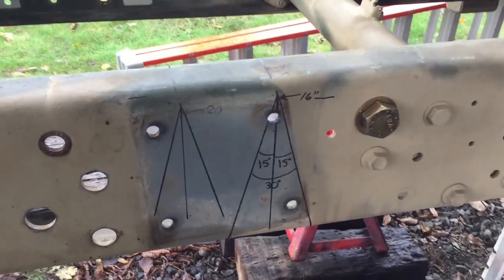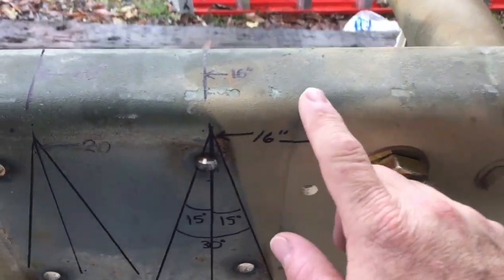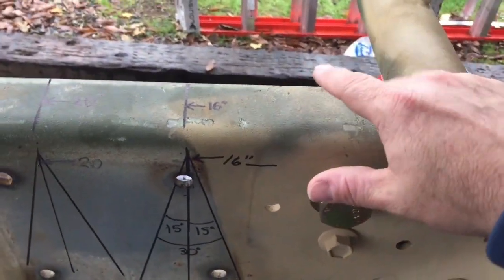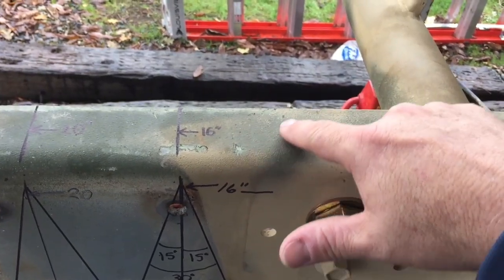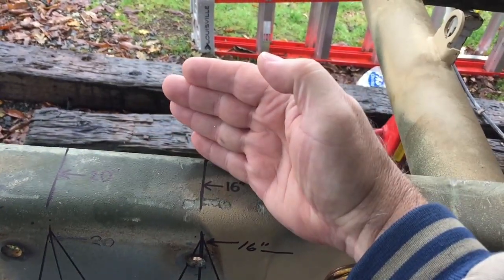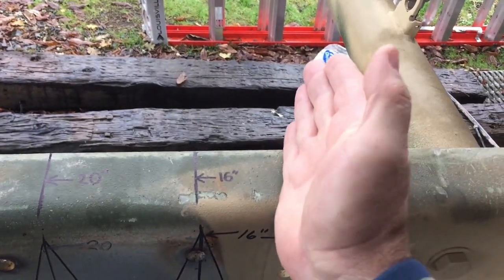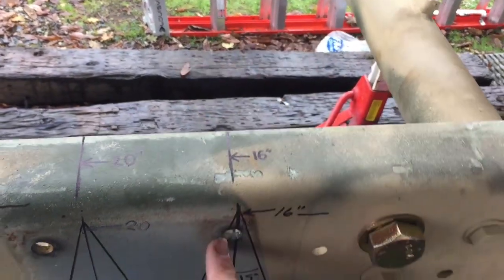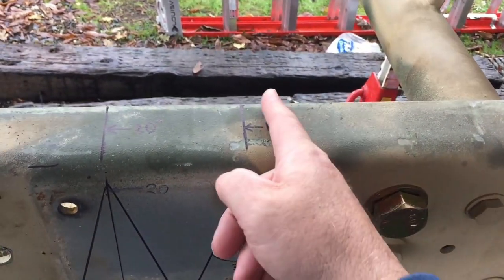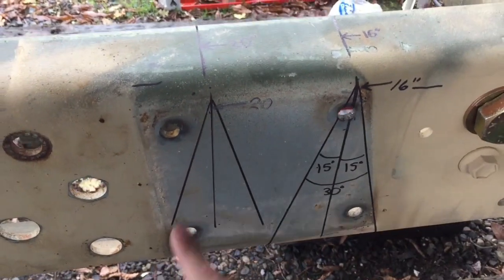I had a little bit of a change of mind here. I initially put this at 16 inches, but it's so close to this member here. I want to put the cut up here to swing this part in toward the center where the lunette ring is going to be. It was just too close to this member to put that notch here and then the notch here — I felt the welds were just too close together. So instead, I'm going to go ahead and put the notch here and then notch this out here.